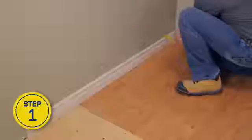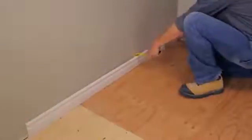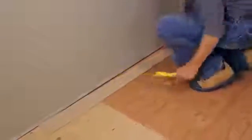3/16 of an inch thick if you don't want to raise the floor level too much. You may also need to trim the doors and door moldings. To do this, mark the height of one tile against the door or the molding and cut at 1/16 of an inch above the mark using a saw.